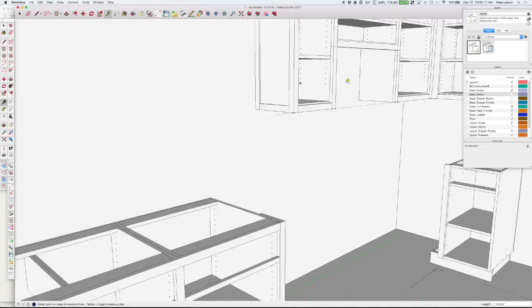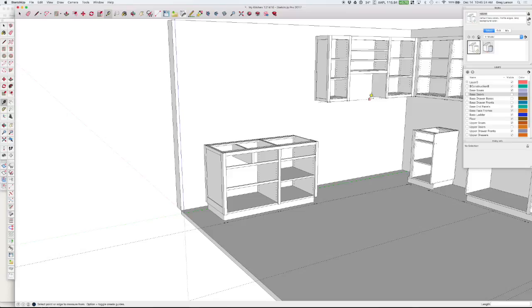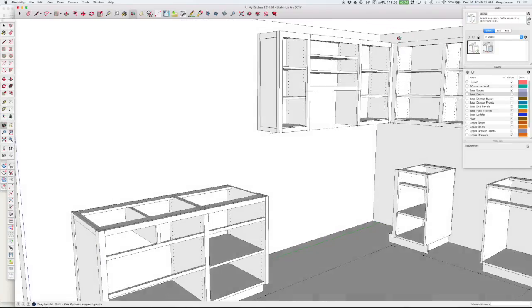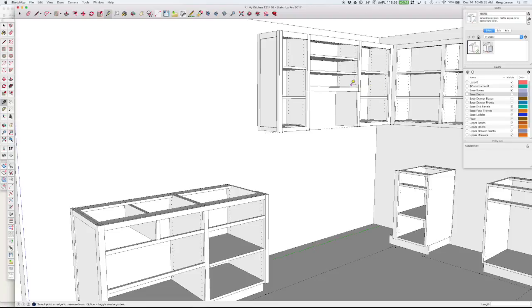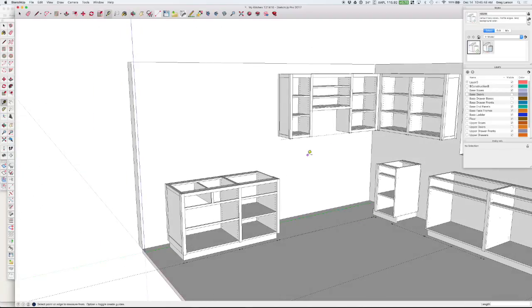Again, because I don't have drawer slides there, we can drill these holes in the sides for you. That's obviously if you have a CNC, you're going to use the selective hole drilling. So this is more for you to be able to see that the holes are going in the spot that works for you, and also it'll propagate to your shop drawings so that you can dimension them and show where they're supposed to go without having to draw them all in one by one. So that one's relatively straightforward.